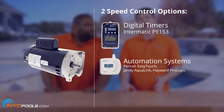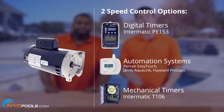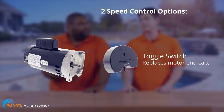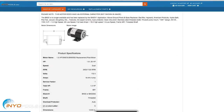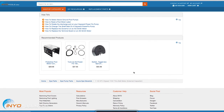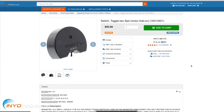Most of our customers already have a timer, like an Intermatic, a simple mechanical timer that just turns your pump on and off. If you have one of those, you can add their T106 timer, which basically just switches the motor from high to low speed. The toggle switch is really easy — you can go high, low, or off, pretty much three positions. That's probably the easiest option. They sell an end cap with a toggle switch built in. And on all of our two-speed motor pages, it should be in the description the recommended switch for that. I'd like to thank CatDaddy44 for that question.